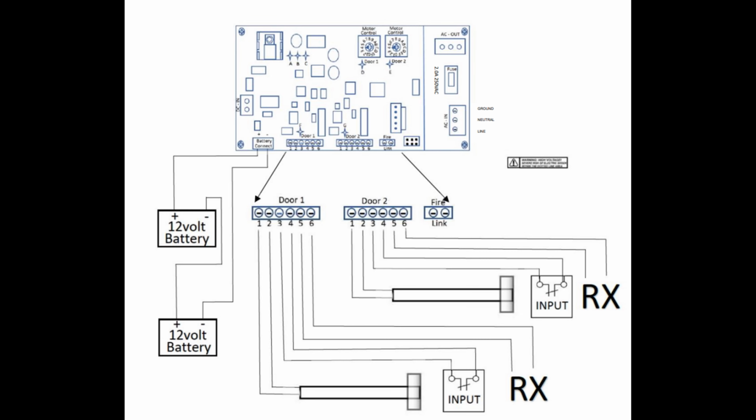So they hit the keypad or the card reader, and the bolts don't retract fully. Someone goes out the door, it comes shut, and the rods aren't retracted. Well, not out. Say someone comes up to the keypad on the outside, keys in, and they open the door because it pulls it down far enough to open the door. Then once they walk into the building, the door comes shut, but it doesn't latch because the rods are back in the lock position, so it just hits the head of the frame.